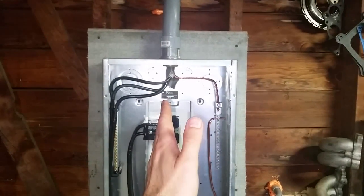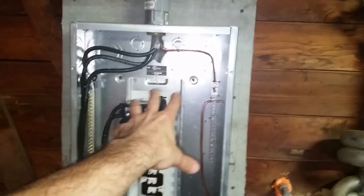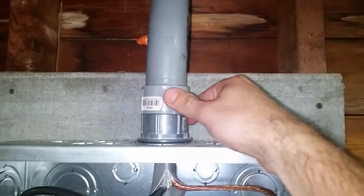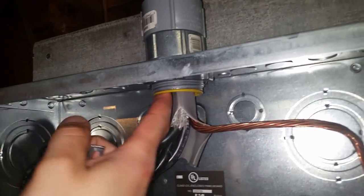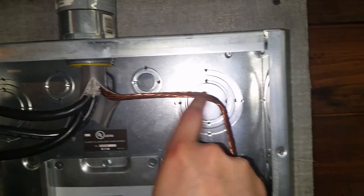Now here's the sub panel inside the garage. The sub panel should always be mounted at a height specified by code — generally at eye level, around 5.5 feet. Check your local code for the exact requirement. PVC connectors thread directly onto the metal panel connectors with the same thread pitch. Make sure you have a plastic bushing where the conduit enters, so the wires aren't damaged by the metal edge — that's per code. This is the equipment ground wire from inside the service entry cable.